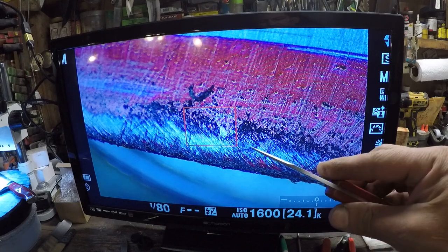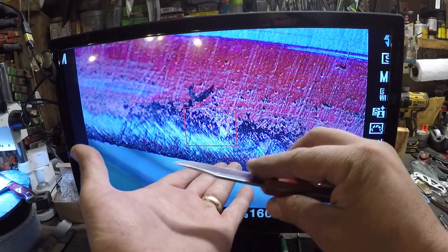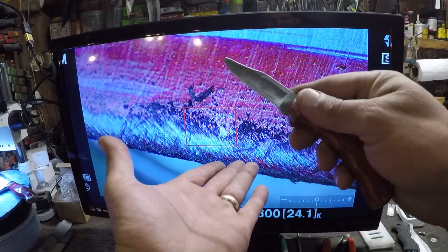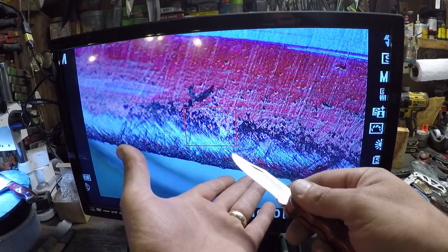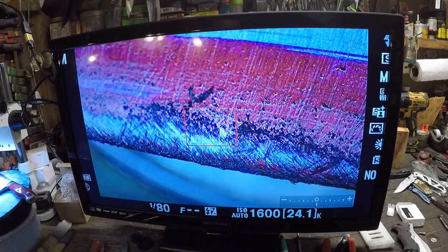Then come back to the original side, sharpen until you get a burr. Go back to the other side, sharpen until you get a burr. You could use that to go in steps if you wanted to, or if your knife was in really bad shape. And we might do that on the next video: go start to finish from an extremely dull knife to a sharp knife, showing you steps in between.